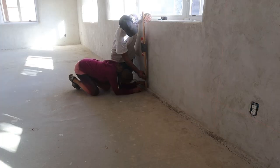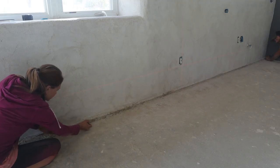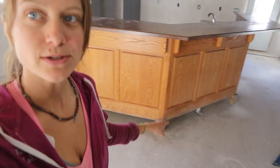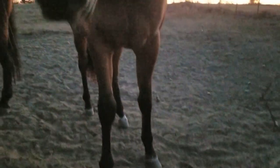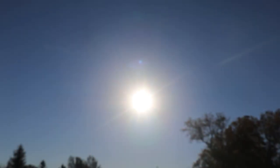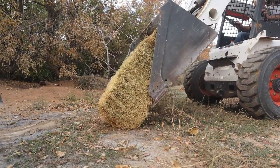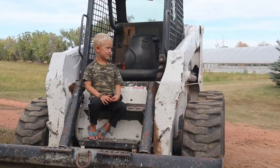We're actually going to go with a half-inch top coat instead of the three-quarter inch we initially said. We realized all the way around our house we need about an inch and a half thickness for our floor, so we want our base coat thicker than our top coat. We'll make marks along the edges of our walls and snap a chalk line as a reference guide while pouring. We also lifted up our island so we're able to pour underneath it.